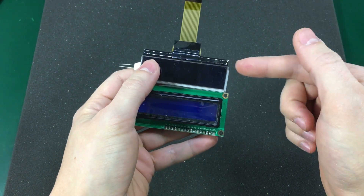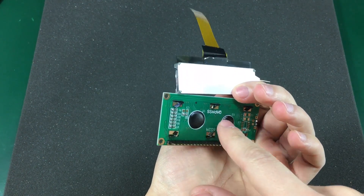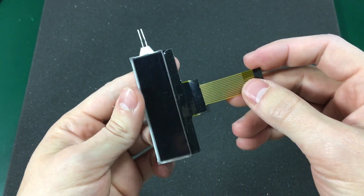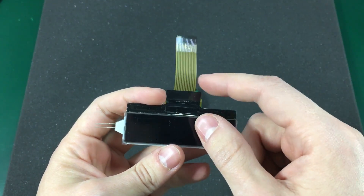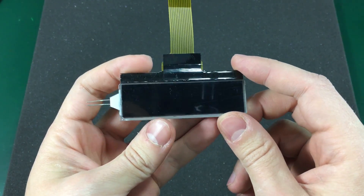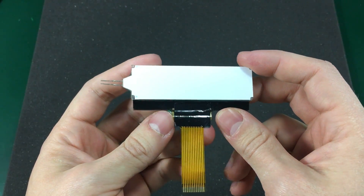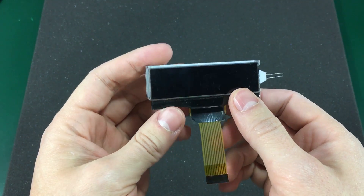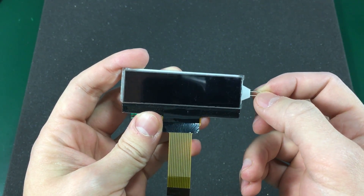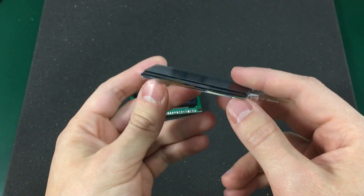Connection is made through this flat flex 12-pin connector. The driver chip is the ST7032 and it should support SPI protocol as well as the parallel interface in 4 or 8-bit mode. There is also another driver chip, the ST7032i, which should also have an I2C interface, but I'm not sure this one has it — I think it's just the plain one with SPI and parallel interface. This will go into my bag of LCDs awaiting a project. It seems to be difficult to find the exact same model; I could only find it on AliExpress, so I will post a link to that in the description below.